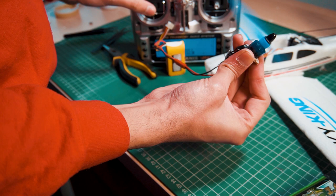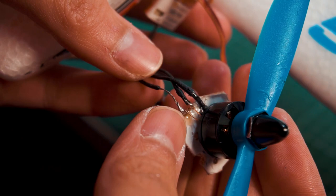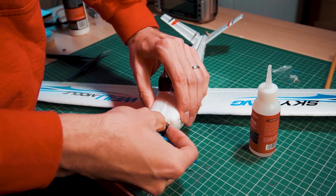I started to test the motor to see if it works correctly and then it started to fail — because this is a rewound motor I did in another project, and one of the connections between the wires going from the ESC to the coil were having trouble. So I soldered them again and put a lot of CA glue to plasticize and harden the connections so it won't happen again. Finally, it's time to put all the electronics inside the airplane.